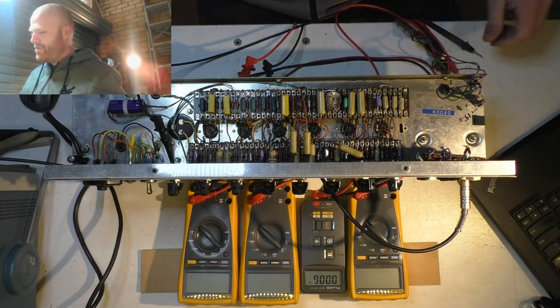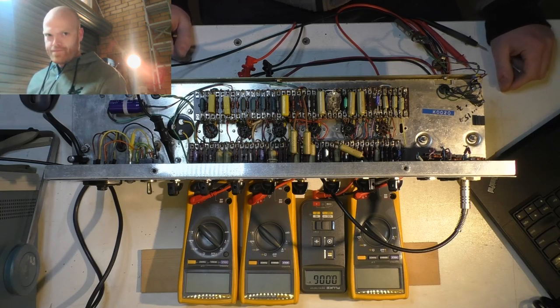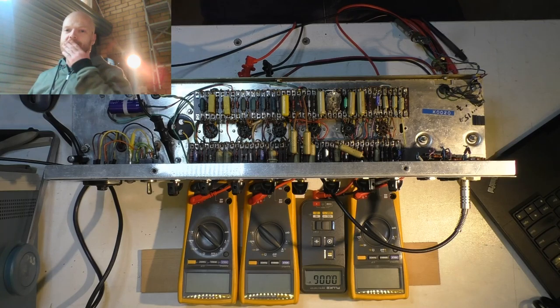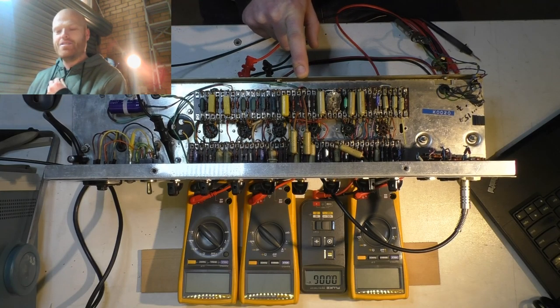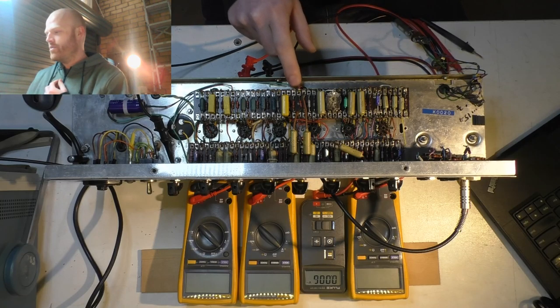Today I am finishing off this Vox finally. Rebuilt half the thing. I powered it up for the first time last night, and all seemed well. The tremolo I forgot to hook up the high voltage to, so the first three tubes didn't work the first go. I realized my error and wired that.